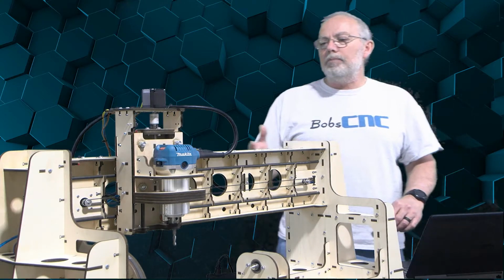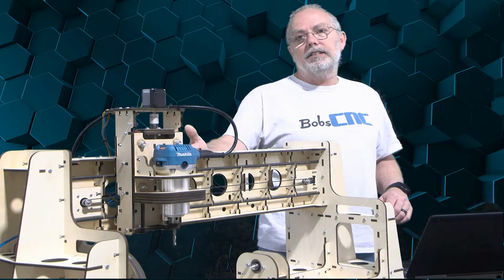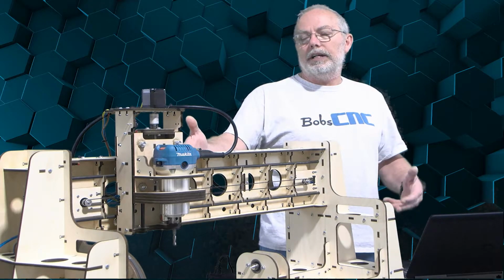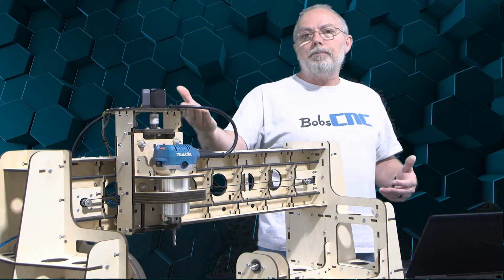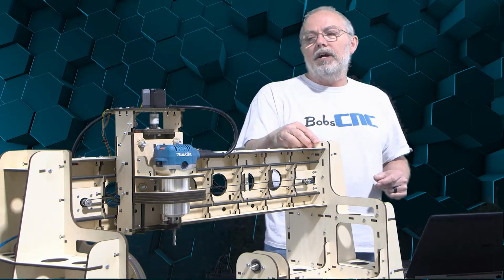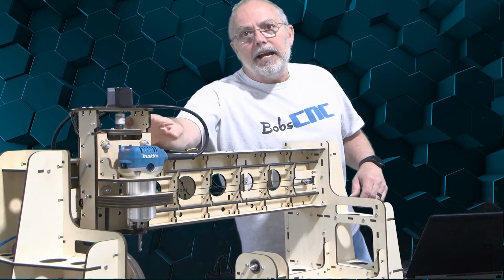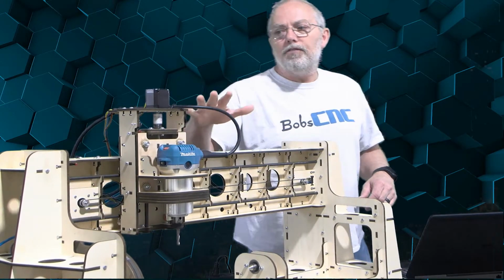The other thing that it could be is the home switch wires are actually not connected to the Z minus, and so it does not know that it's supposed to stop there. We have a video on diagnosing home switches. Definitely check that out.